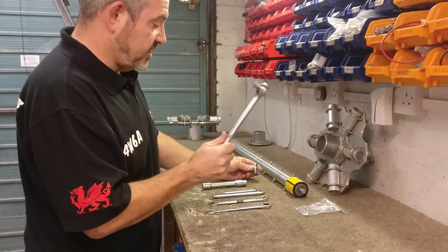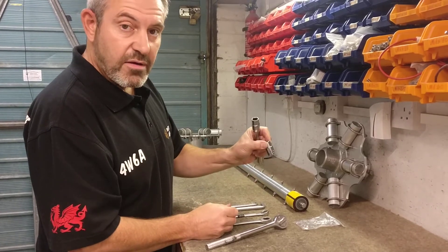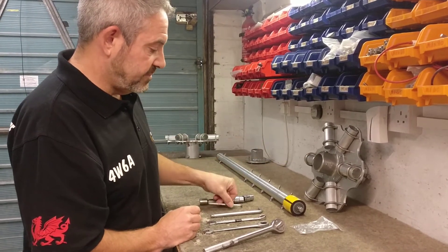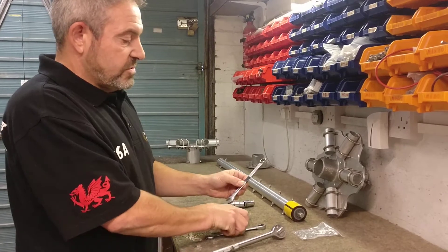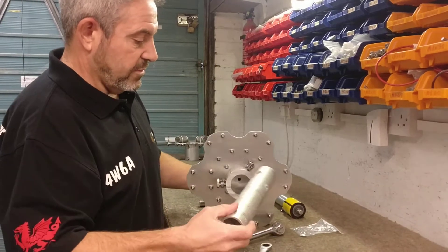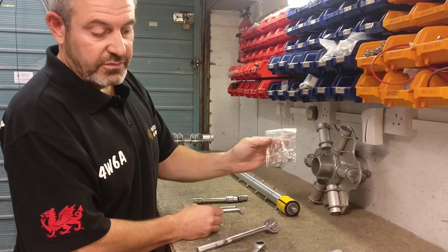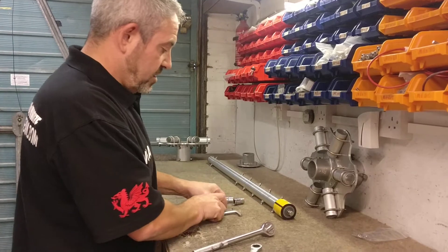The antenna tools you will need: a socket wrench, 13mm or imperial half-inch socket with extension bar; a 4mm allen key for fixing the top flange; an 8mm allen key for tightening the grub screw; and two 13mm or half-inch spanners for when we insert the step. If you drop any nuts, bolts, or washers, there are some spares provided in the package.